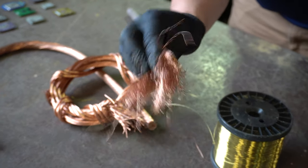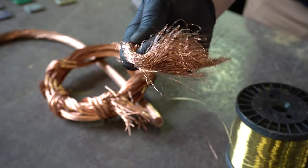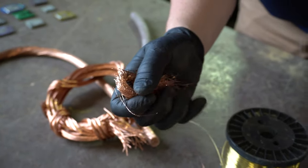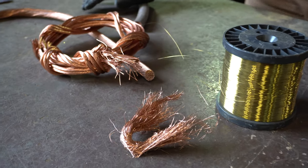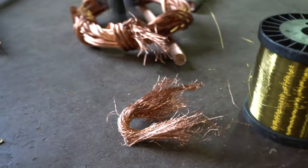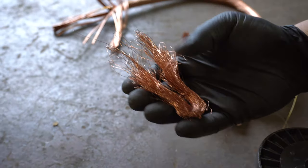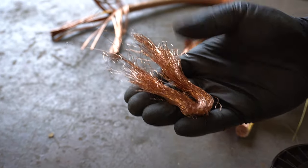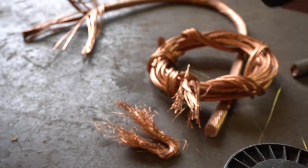But if it looks like this, where it is bare bright on the outside and on the inside with no coatings, no enamel, nothing like that — one of the primary reasons it does not go as a bare bright is when it goes into the furnaces, it melts so quickly that unless they have it at the bottom of the furnace, there's a very high chance it could easily lose 10 to 15 percent of the material just by burning up so quickly and going up with the smoke.